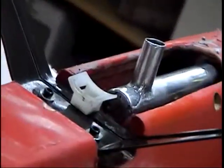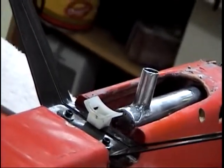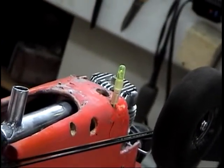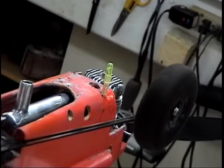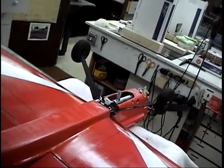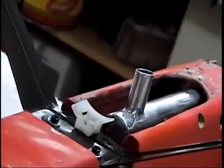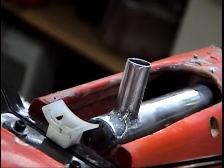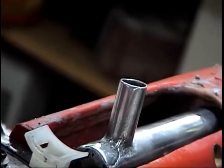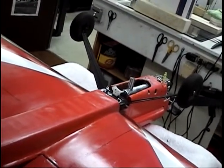Now, as I've done a lot of testing, I've eliminated a lot of things out of my repertoire here. And number one was, with the 90, at the state of tune it is now, it definitely needs some decompression. It definitely ran better with the smallest venturi that Rich provided us with. In fact, I just added some more pantyhose. And for sure, we know it ran real well. These numbers are not all exactly the same, but you need to have a definite restrictor at the end. It's called a belly bleeder, if you want to be technical about it.